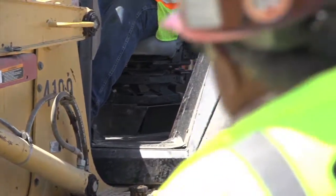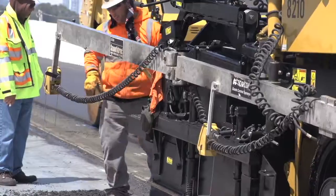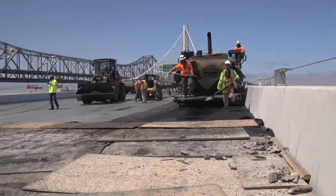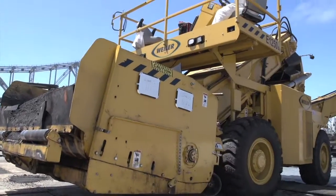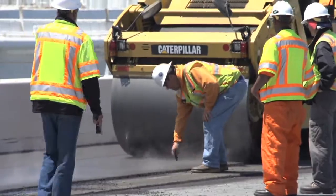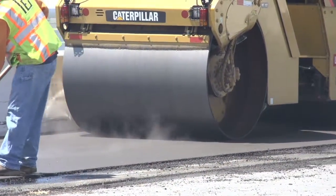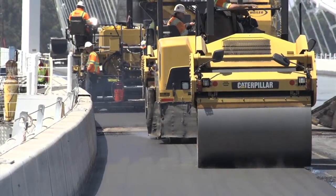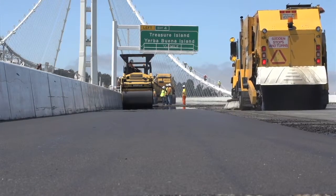As in any dance, timing is everything. There's a lot of timing involved — as the workers shovel the asphalt out onto the deck, they're packing that down, and then that asphalt has to cool a little bit before you can really do that first layer of compacting. Then it has to cool a little bit more and you compact it again. Then it has to cure for 48 hours before any trucks can drive across it, and then you do the same thing a second time.